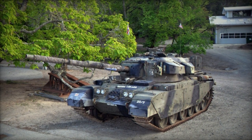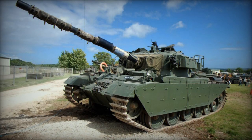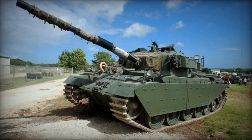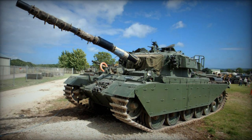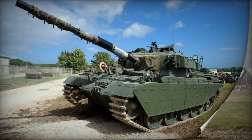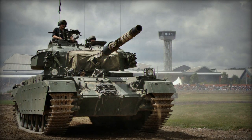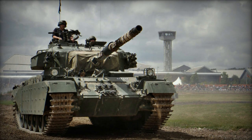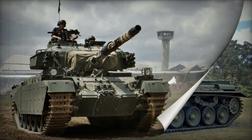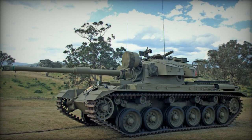The accuracy of firing from the tank on the move is ensured by the installation of the armament stabilizer in two guidance planes. The vertical angles of guidance of the tank gun are elevation angle plus 20 degrees and declination angle minus 10 degrees. The vertical and horizontal gun pointing mechanisms are electrically driven. The ammunition capacity is 65 rounds for the gun and 3,600 rounds for the machine gun.